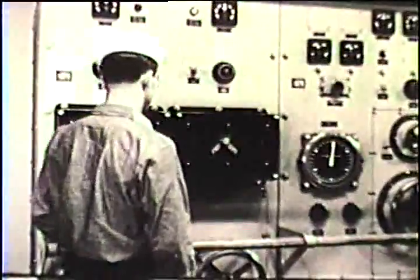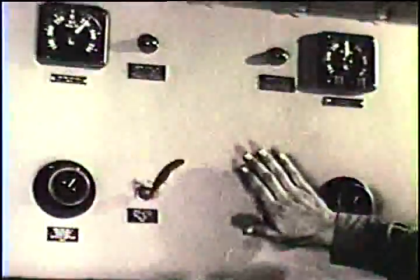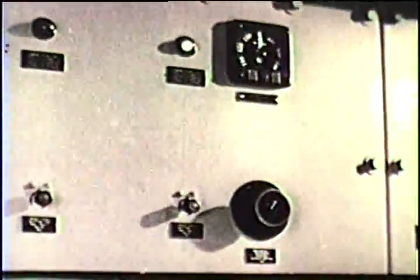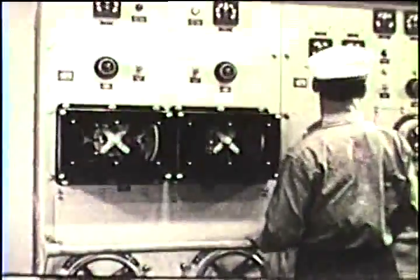Generator field contactors fail to close. If the generator field contactor fails to close, the indicating light stays lit when the generator transfer switch is turned from bypass to propulsion. First, push in the reset push button for the engine fault relay. If this is the trouble, the light goes out. Or sometimes the light stays on even after the reset push button has been pressed.